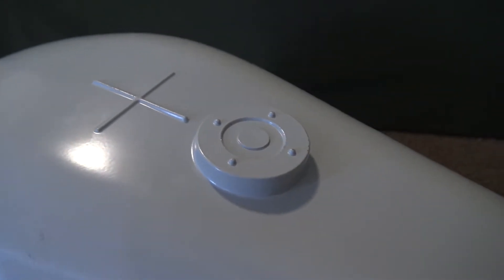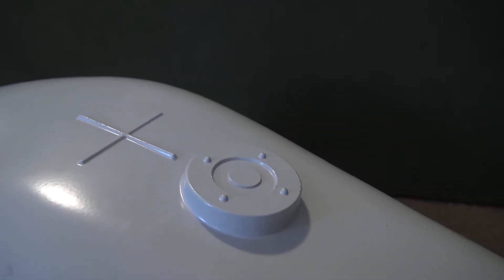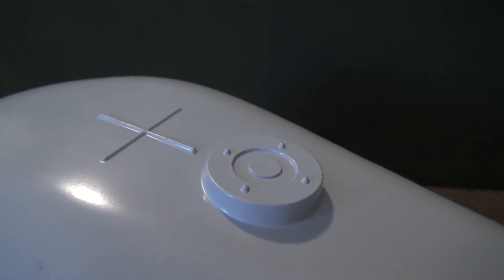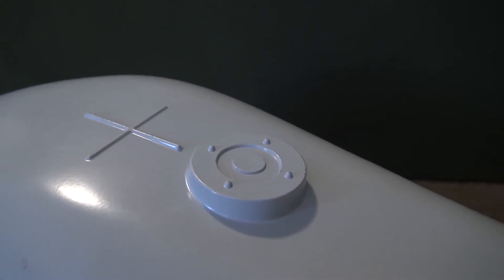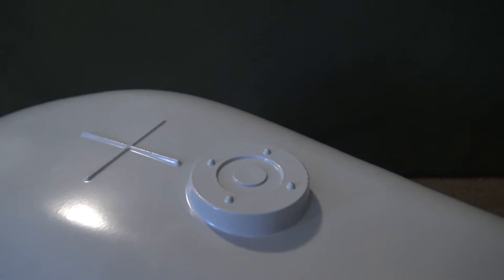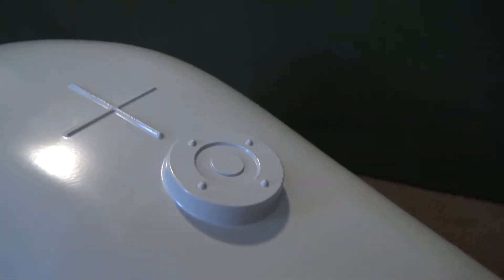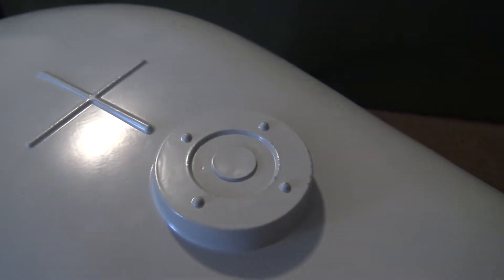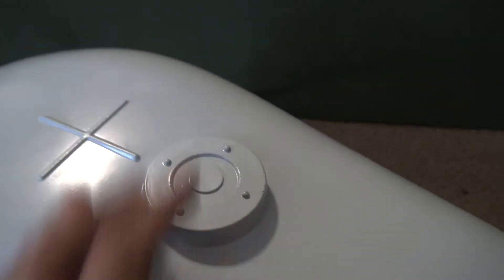I do have plans on adding a photocell socket to this fixture, because I love photocell sockets — it's just another way to show off what the fixture can do. I have a brand new GE photocell socket that came off a bad, busted-up General Electric Evolve LED. The very early ones have the same exact photocell socket, so I'm just going to put it on here and it'll fit and work exactly the same. Without a photocell, this is what it looks like — just blank on top — and you can see where the dimples would be to keep the photocell socket in place.